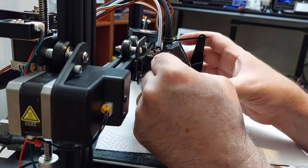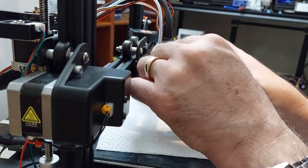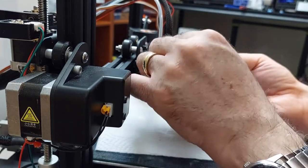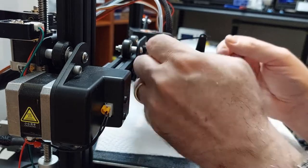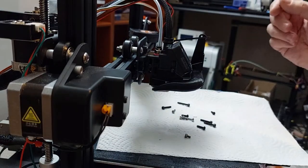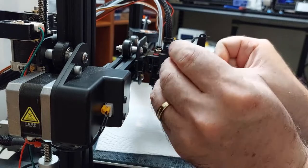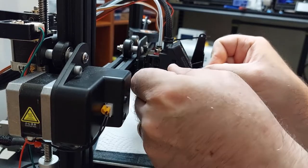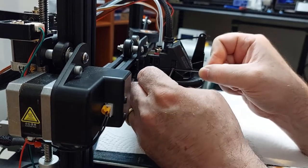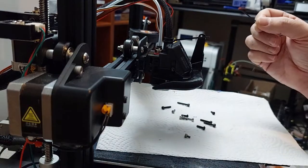Now that I've properly adjusted the nozzle height and the fan height, I'm going to move the camera to cinch in the screws, but you can't see anyway because my hands are in the way. And you'll see the paper towel I usually leave on my bed — I put something on there while I'm working so I don't drop anything and dent or damage the build plate. So you're just going to snug your fan height and then you're pretty much done. I'm going to hook up my blower fan and then I should be good.